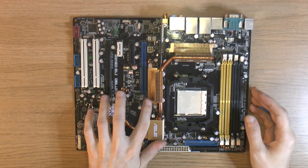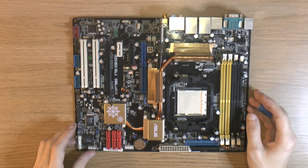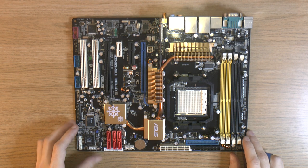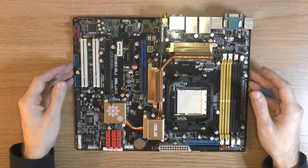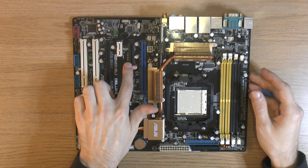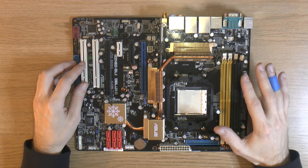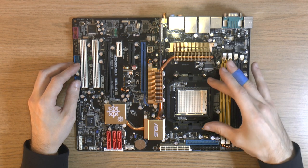So this is an SLI motherboard, and it's also why I kind of realized maybe I can do quad SLI. But obviously when I tested my graphics card thoroughly now, I realized one actually isn't stable, like I said. So this, we're gonna scrap that and do a vertical mount here instead. So this motherboard is an nForce 590 SLI chipset. So you got 2x16, then I got 4x, 1x4 and 1x1. I don't remember the exact number, and I've seen different numbers, but I think this chipset by itself has something in the order of 36 to 38 PCIe lanes. It's quite well equipped. It's an AM2 motherboard.